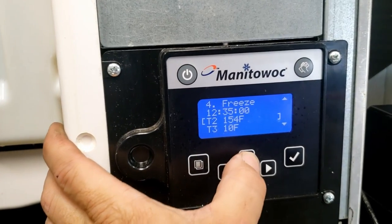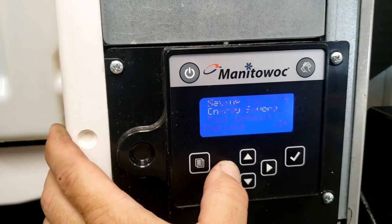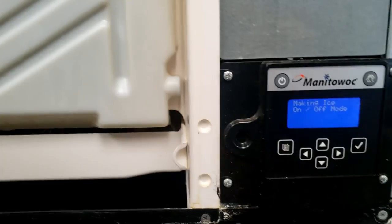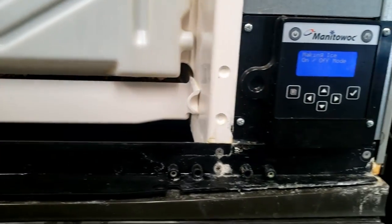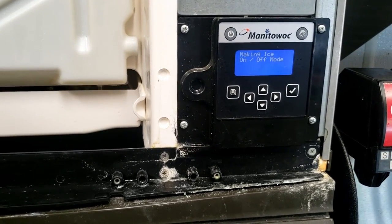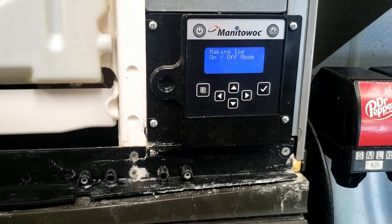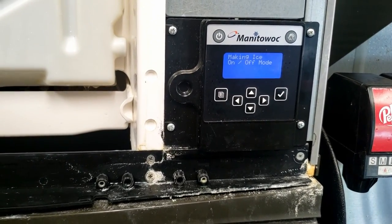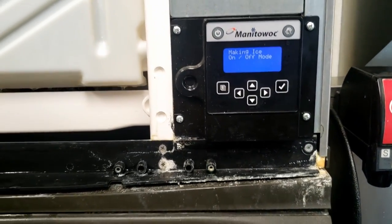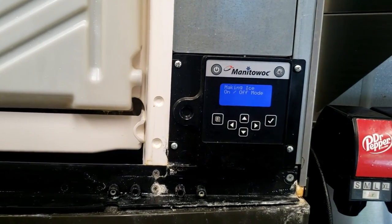We scanned it for leaks — didn't find anything down here, but it could very easily be in the coil up on the roof. We'll leave it up to them whether they want to look any deeper. This is not the right way of charging — they're supposed to pull it out and weigh it in. But I looked at the total charge which is seven pounds, added a little to it, and based it off my superheat, valve, liquid line temperature, condensing temperature, and the suction pressure charts all combined. That's how we came up with it.